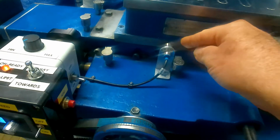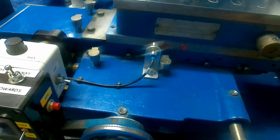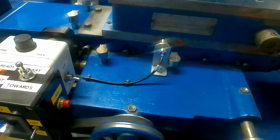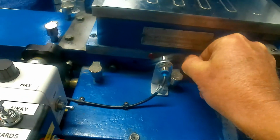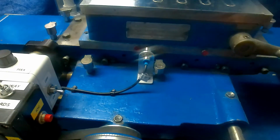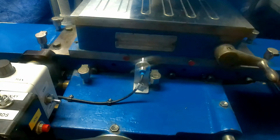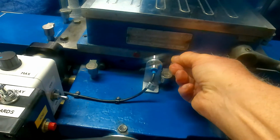So imagine that's the stroke that you've got there. Each time the magnet approaches, as the table's going along, it's feed, stop, feed, stop, etc., as it goes backwards and forwards. But of course, being electronic, if I take that magnet out of the way and still do the same stroke, it only works in one direction. So in effect, you can do cut, spring cut, cut, spring cut. So that's the way that I've set that up.